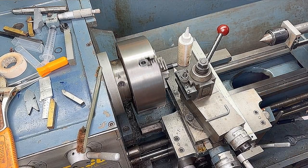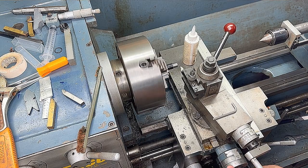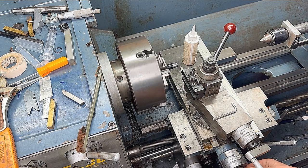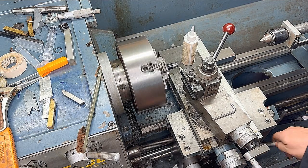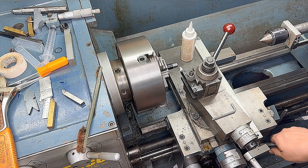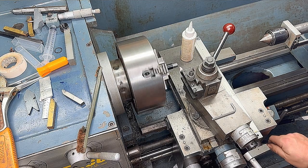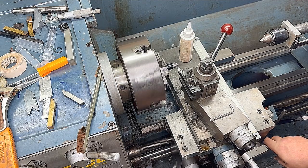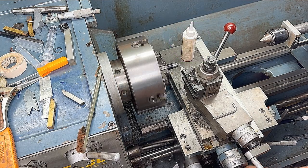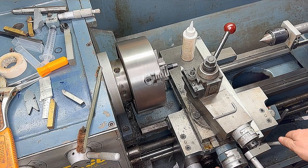As you've noticed, I don't have the live center in it — there wasn't enough room — so we need to make sure we don't cut too deep, which would push the barrel and flex it and possibly give us threads that aren't correct. At this point it's just a matter of going back over those threads with the carriage until they reach the minor diameter we've already turned into the barrel. These are 28 threads per inch, so you can catch it on the even or odd numbers. There's a little dial indicator on the carriage that allows you to index each cut so they line up properly, and we'll keep cutting deeper until we get to the right depth.